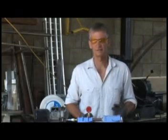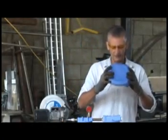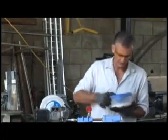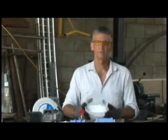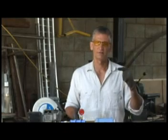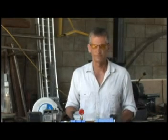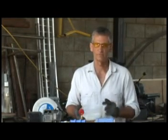These glasses actually protect my eyes. Now we're going to take our lye. I put it in this nice little Rubbermaid box to keep it dry. If you get the stuff wet, it clumps together — it'll start fizzing and burning. I cannot emphasize how safe you have to be with this stuff. Now let me show you what it looks like — big old snowflakes. We're going to measure out a little bit and drop it into the container. We're going to have the current on so you can see when the process of electrolyzing begins, because there will be no process until we drop the lye in. In this way we will control the current of the electrolyte solution. The more lye you put in, the more current you flow. You don't want too much current and you don't want too little.